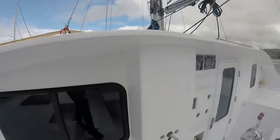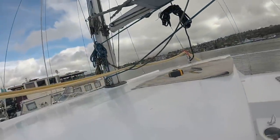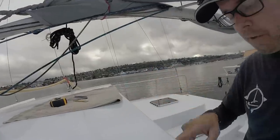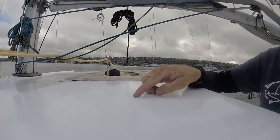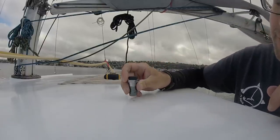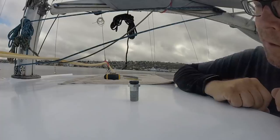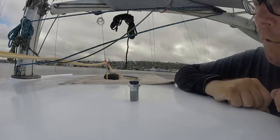So here's what I'm doing. Here's my Capilano. The fill hose needs to go from here to the upper deck up here. So what I did, took a center mark and just put it right here. Measured back, needs to go about 9 inches. I need to drill a 3/4 inch hole right there. And that'll allow us to put the hydraulic fluid in the system.